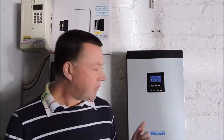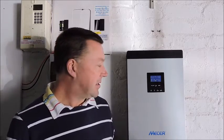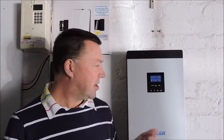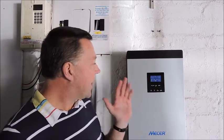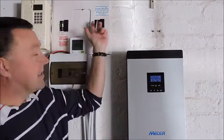I've gone for a Taiwanese inverter. I started off with the 3K — this is a 5K VA. You do need a little bit of extra capacity to cope with surge loads like pool pumps, etc. And I've gone for a battery pack — 8 batteries, 102 amp hours each, about 800. And I've wired it in, with the help of a sparky, into the existing DB board.